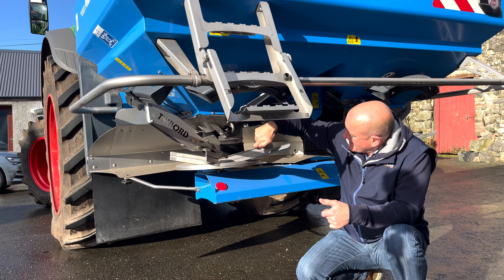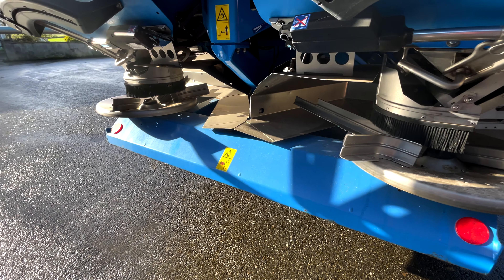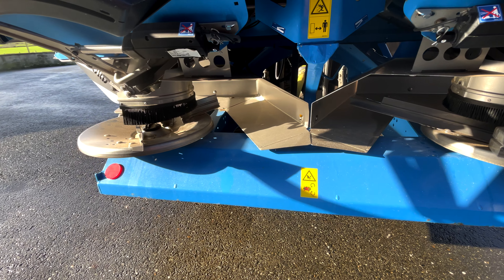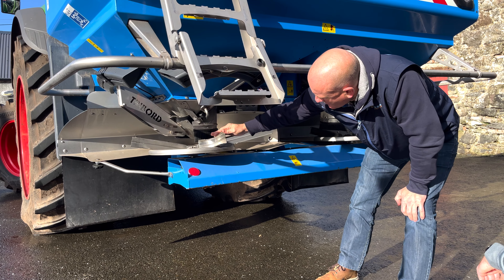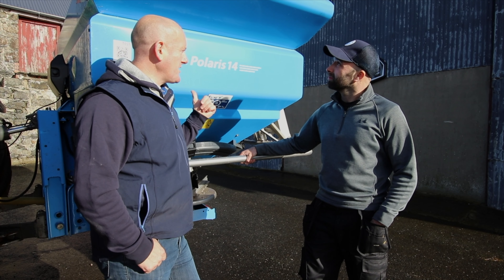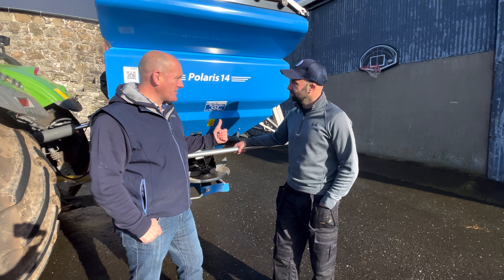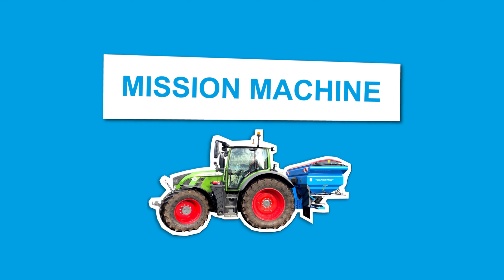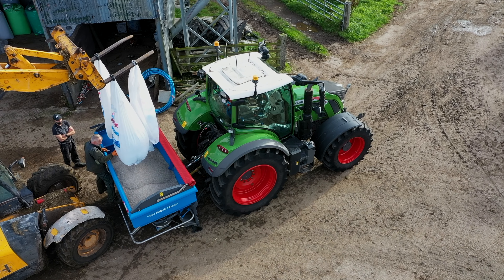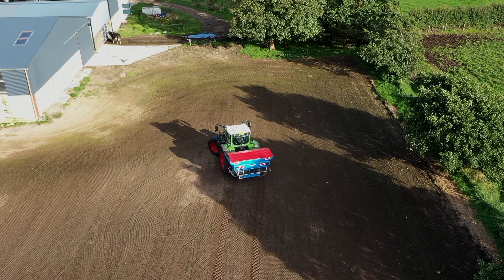When we go in here, your side shutter opens up, feeds the fertilizer down using the P-arm here, and places it onto the disc. Your width is determined from that. What you have here are epsilon vanes — the reason for that shape is it helps greatly with your section control, because as the fertilizer is fed out you can control certain widths using the epsilon vane. The wear pattern is also much better because you're splitting up the direction of travel, and that's also relevant to your border spread.